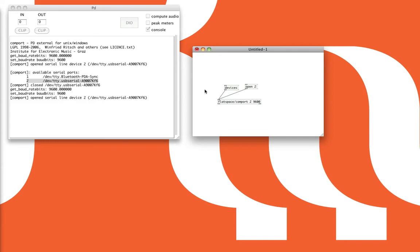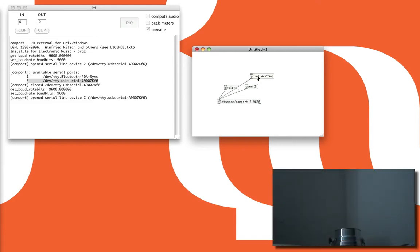I've configured my DMX lamp to start at address 1 to receive messages. Channel 1 is red, 2 is green, 3 is blue, and 4 is the shutter. We want channel 4 to always be at 255 — the maximum value — so we can control brightness with the other three. To send messages to the Arduino via serial through COM port, the syntax is 'print', then the channel number — in our case 4 — then 'C', then the value we want to send, which is 255, then 'W'. Connect that to COM port and send the message — you should see the lamp flash.